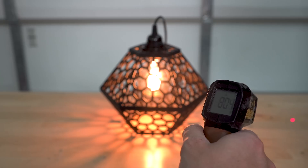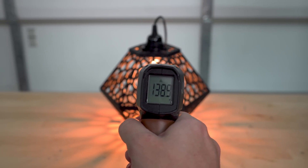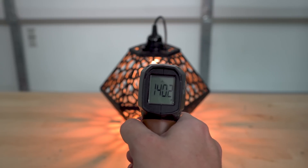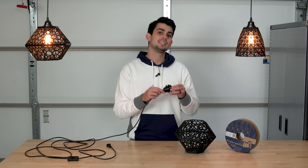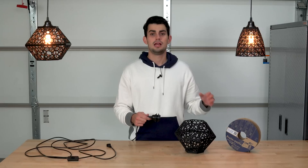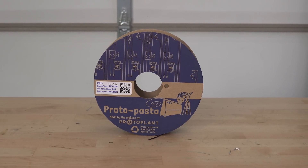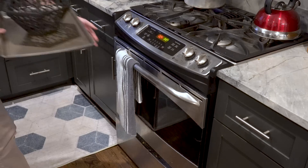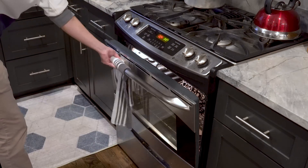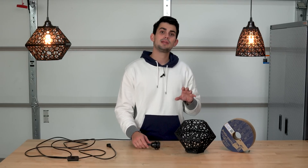If you go with a tungsten filament bulb for your light source, keep in mind that these get very hot — hotter than the heat deflection temperature of PLA. So if the shade is touching the bulb or a metal socket that conducts the heat away from the bulb, it will soften to the point of sagging. This pendant light has an insulating plastic socket and the shade is wide enough that the radiant heat from the Edison bulb won't melt it. However, I would still recommend using a heat-treatable PLA like the one offered by Protopasta. After you finish printing the model, you need to anneal the polymer in an oven to get better thermal properties. I designed the cylindrical shades to have a couple of different lattice types.